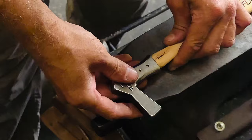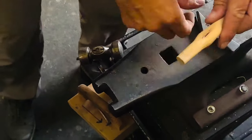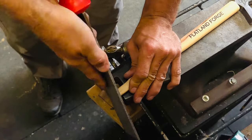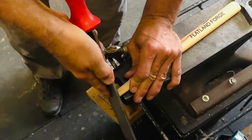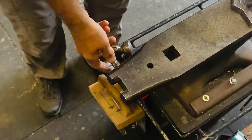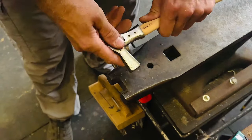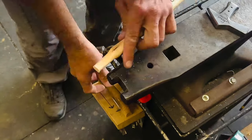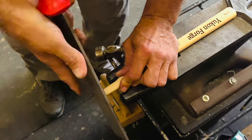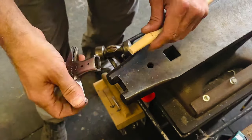When I fit the hammerhead back on the handle, the handle shaft was a little bit long. I went ahead and filed just a tiny bit off the top of the handle and had to do this a couple times until it fit nice and snug. I shaved a tiny bit off the end and now it fits nice and snug.